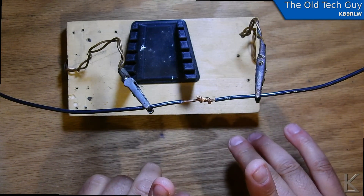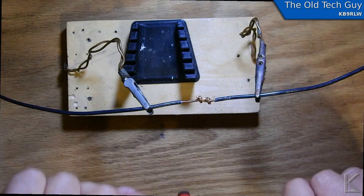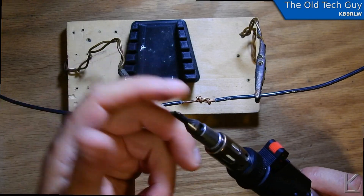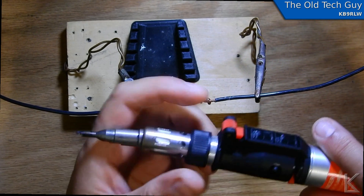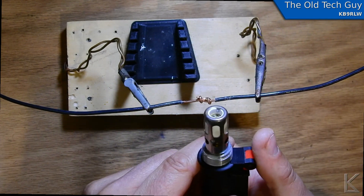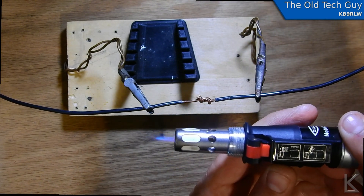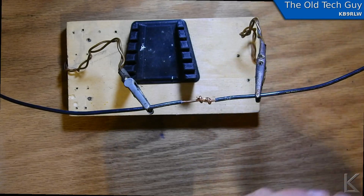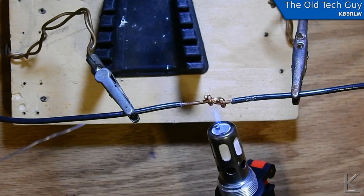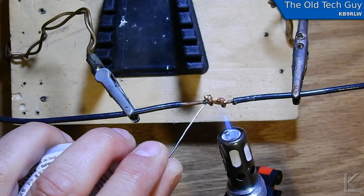Now, while the soldering iron is heating — when I did this outside, I used my butane soldering iron. The tip can get kind of hot, get plenty of heat, but if you're outside and you're in the wind, you can unscrew this flue guard and now you have a pencil torch. And when you're outside, you can use that pencil torch. We'll just heat that up real good, get the tip of the flame on it for a moment, get the wire good and hot, and the solder just flows right in.